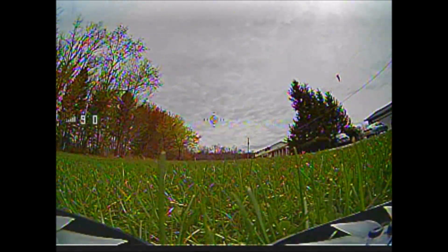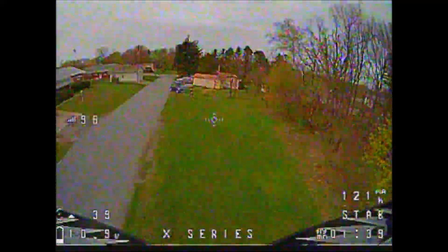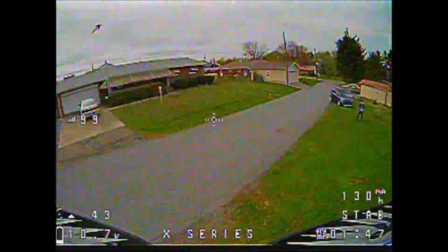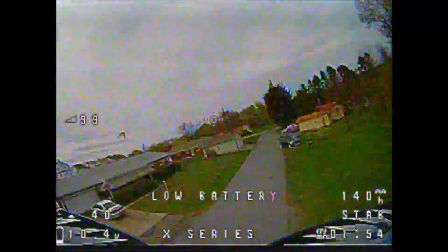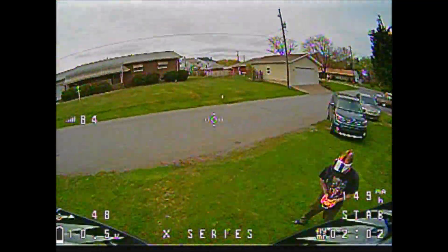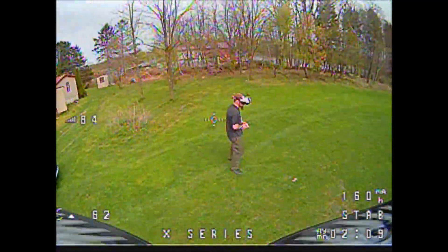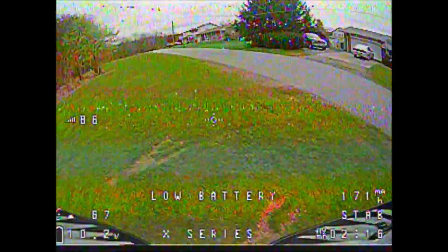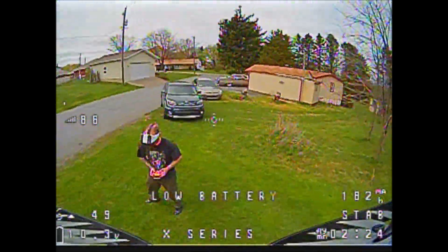With the antennas below the prop guards — I originally had them above — we're not even hitting that yellowish tree, which I'm guessing is about 50 meters, maybe even only 25 meters, and we're getting heavy feedback. Can we fly through this feedback at 25 meters? Yes. At 50 meters? Possibly. Any further than that — it is unflyable. We are getting ridiculous snow-outs. I'm just going to burn the battery. This drone ate me alive. I came inside so frustrated at what I paid for and the range I was getting.